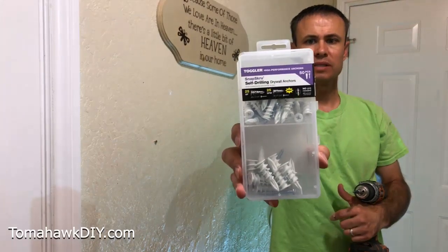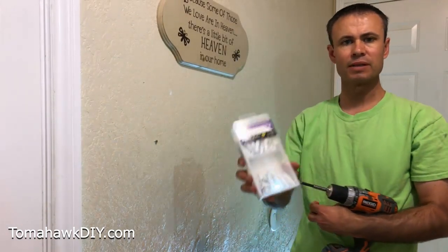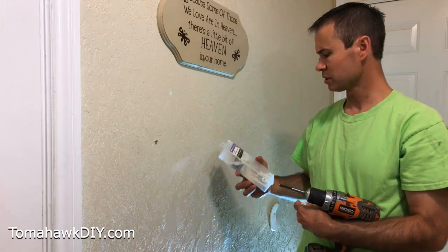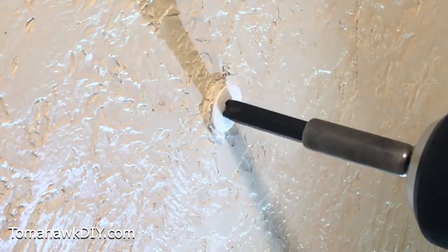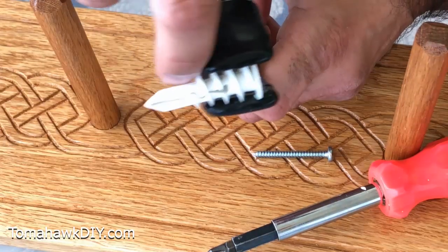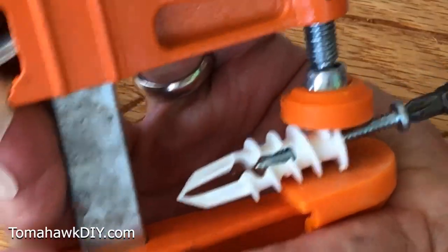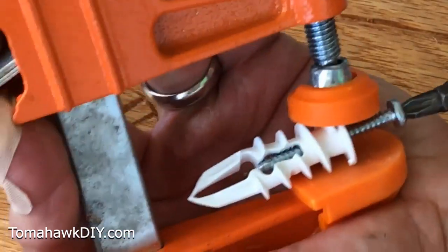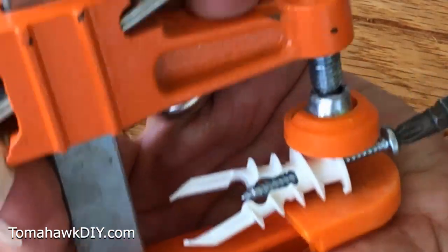My second location over here — I've checked and I don't have a stud here. For this one, I'm going to use one of these snap screw drywall anchors. These are my favorites. I'll put a link on Amazon where you can pick them up. Any affiliate links you click send a small commission my way which helps support Tomahawk DIY. I'm going to put this into the drywall here. I want to show you how this toggler snap screw works — how it's going to pop open. As it goes through, it's going to start pushing this apart. We're going to hear it snap when the plastic breaks. The screw's widening it. That's how this snap screw opens up to help hold as a drywall anchor.